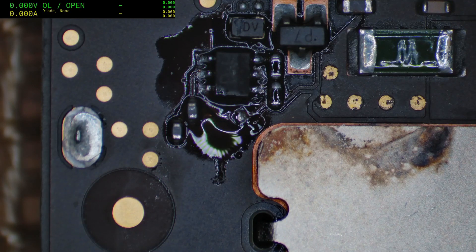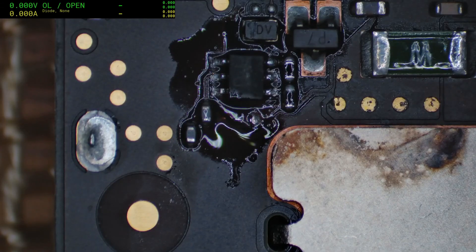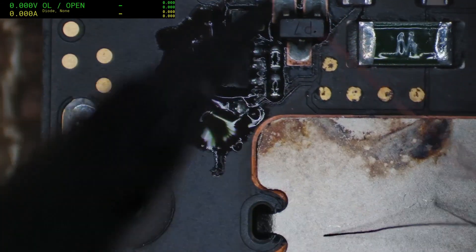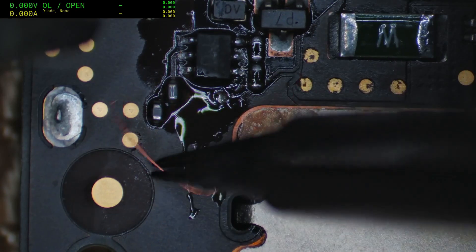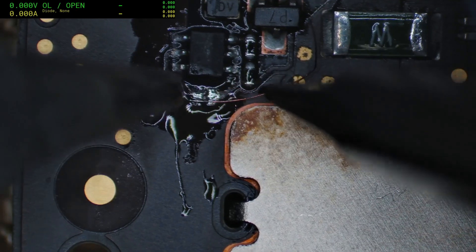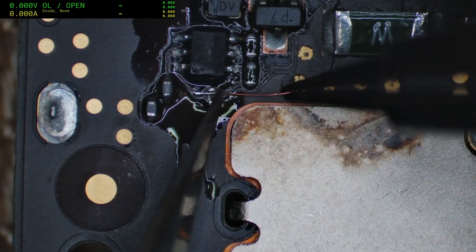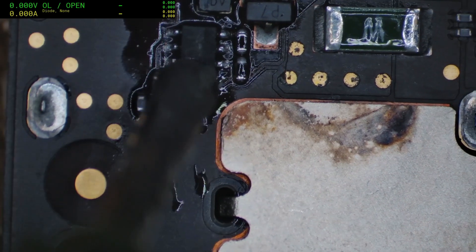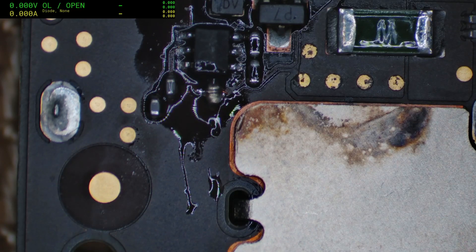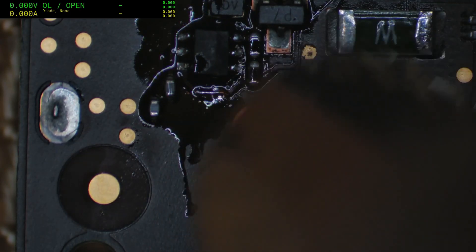We pre-tin that, and I'll get some Litz wire — as you all know, it's my favorite kind of wire for these fixes. I'll grab a strand with my tweezers. The beautiful thing about Litz wire is that it just tins so easily — you don't have to fight with the enamel. I deliberately left a little dag on the end, and I'll hit it with some hot air to get it to reflow nicely. I really hope this is a fix — I've been battling with this for a while now and it's starting to get to me.